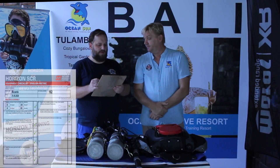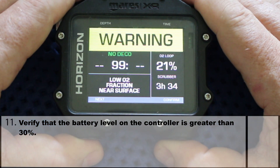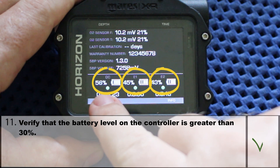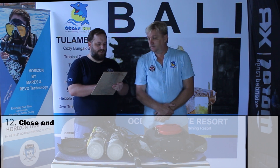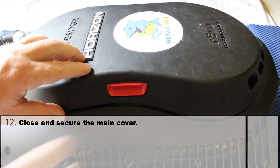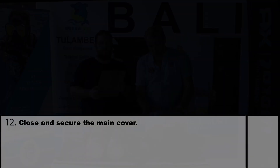We also close the battery compartment. Number 11: verify that the battery level on the controller is greater than 30%. We check the controller and select information on the right, confirm twice, and we can now see the charge level of E1 the first sensor, E2 the second sensor, and DC our controller. Number 12: close and secure the main cover. It's a simple click system — hook in here and snap into place on the other side. Do not close by force and check whether the loop is properly engaged.